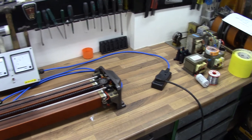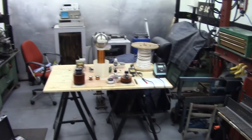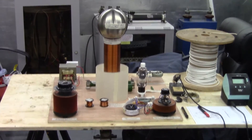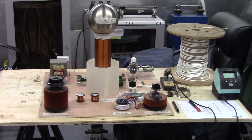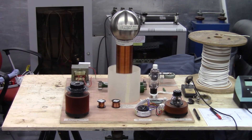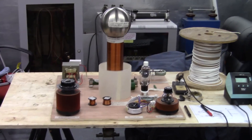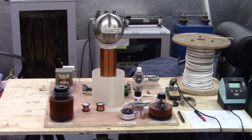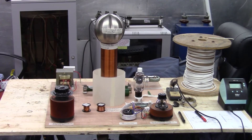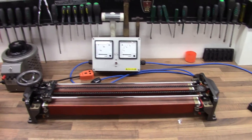So that will be future projects for this. You won't see it for a little while because I'll be working on this guy over here, which is the vacuum tube Tesla coil running on a little 811. It's a breadboard-type setup, literally for experimenting — all well spaced out so I can add or remove components and play around with values. That's laid out ready to be wired up now, so you'll see the VTTC project in upcoming videos.